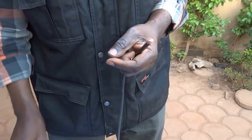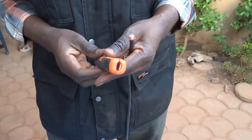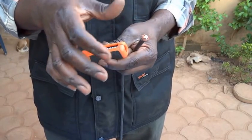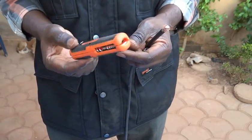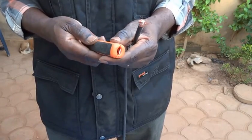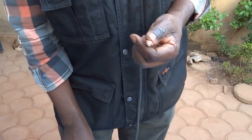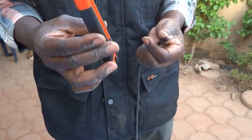It's good to know that there are also different tools and devices for uncovering or preparing coaxial cables. I have this one, for example, with different holes for different diameters. You can use it, but frankly my experience is that these devices are good, but for preparing this type of coaxial cable, they are not as efficient as simple tools like this cutter that you see here.